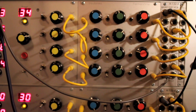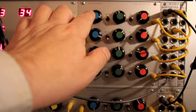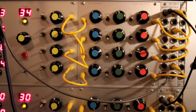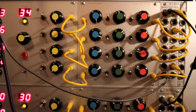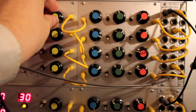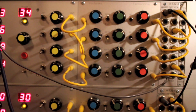Let's hear the raw sound of the Trautonium. It's worth doing because if we drive the input gain stage of the filter, we do get a subtle interaction as the waveform begins to soft clip. So let's try it with the gain up. And I'll bring it down — both the output stage of the subharmonic generator and the input stage of the filter.